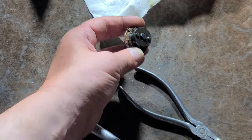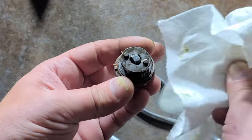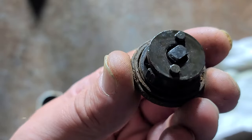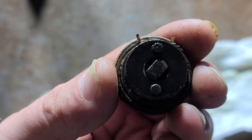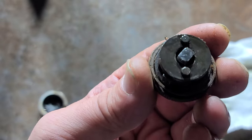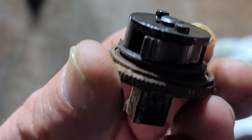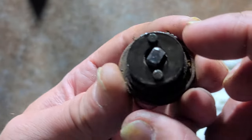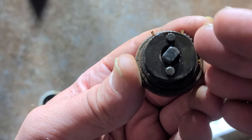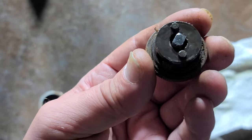The difference in sounds — there are two ways that they do this. One is both pawls basically work simultaneously to double the strength of the ratchet. Sometimes what they do is allow thicker teeth, but each pawl is just slightly offset. So if you have say 40 teeth and one pawl is half a tooth offset from the other, you effectively get an 80-tooth ratchet.